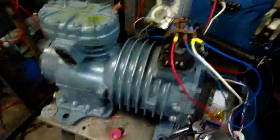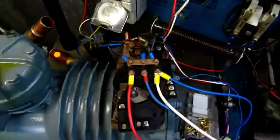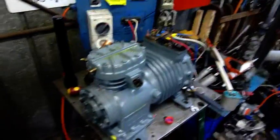That's probably one of the dumbest things I've ever done with a three-phase motor — I forgot to change the configuration and I was trying to run it in 415-volt star with 240 volts. I've got to take the bridge plates off and put them across into 240-volt delta configuration. It might run a bit better when I do that. I was just mounting the king valve and realized it was still in 415 mode — it still works but pulls a lot of amps.